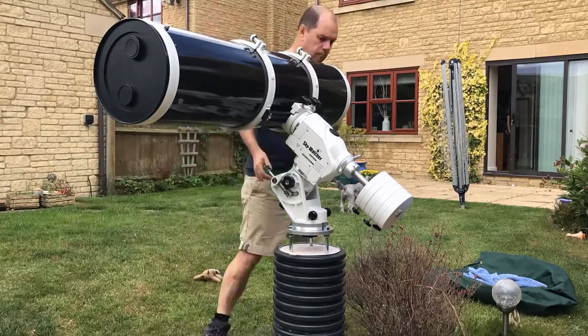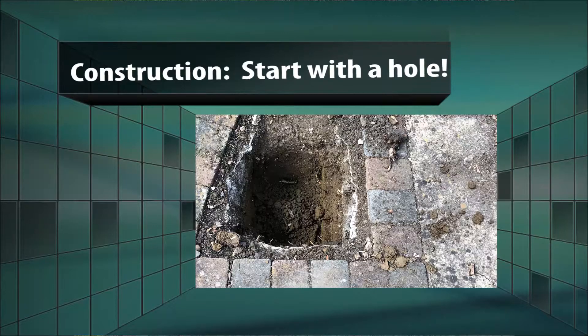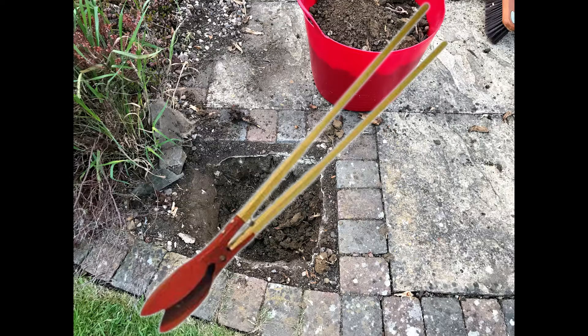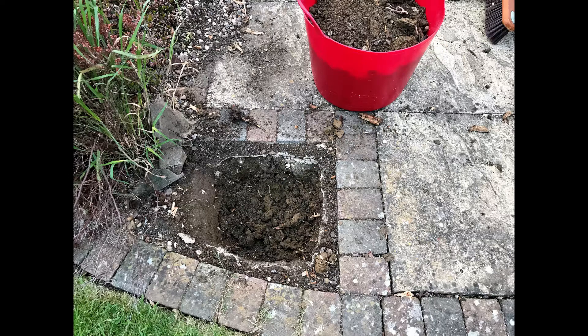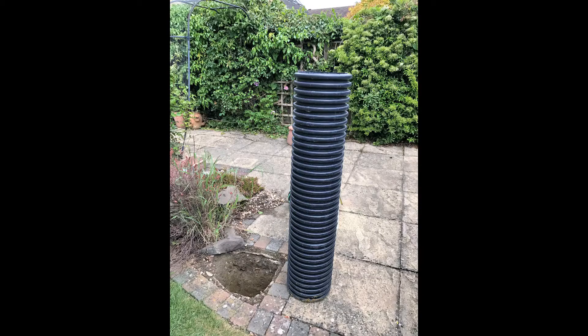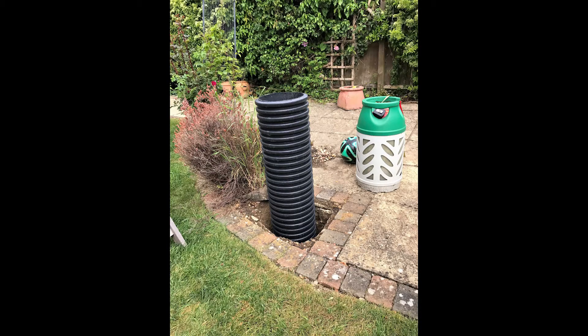Start with a hole — it needs to be at least two feet deep. I had an area of the garden with a tree in it, so I started to dig it out, then used a hole spade to go right down to about two feet. I used reinforcing bar inside the hole. Here's the drainage pipe, cut to size — one meter reinforcing rods driven in more than half their length.